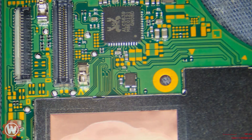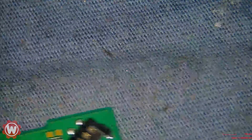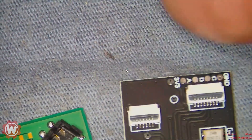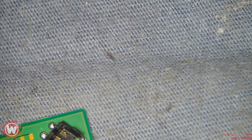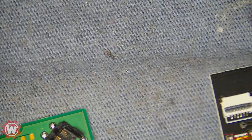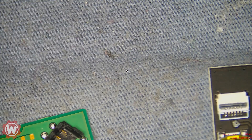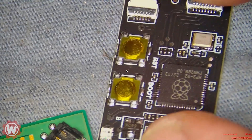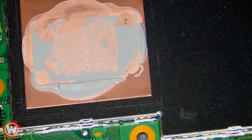As you can see, I have the board open. This is an OLED. We're going to be installing this chip here, which is the latest RP2040 — it works very well, very stable. A lot of people like to install the NX Instinct, but they both do the same thing. They claim the Instinct boots faster, but these have come a long way and boot in seconds, so I can't see much of a difference. I recommend this one, but let's get to the installation.